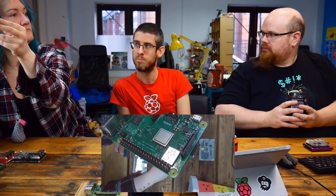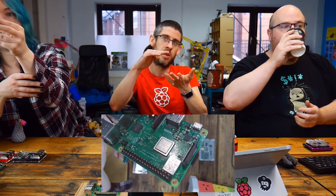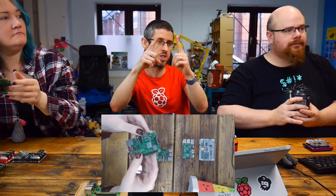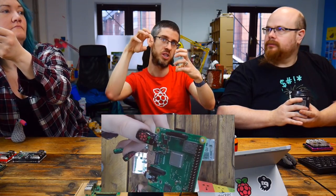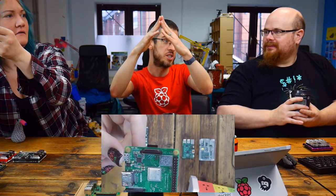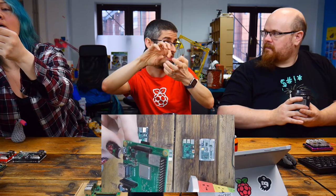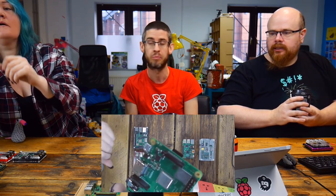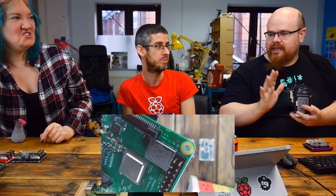It's kind of interesting. I was reading about it, and apparently it's essentially a cavity through the ground plane of the board. Because it's in a triangular shape, the radio waves that come in resonate in that cavity and then get focused down to the end of the triangle. And that's where you get your gain, and that's where it's all received by the circuitry. It's very cunning.